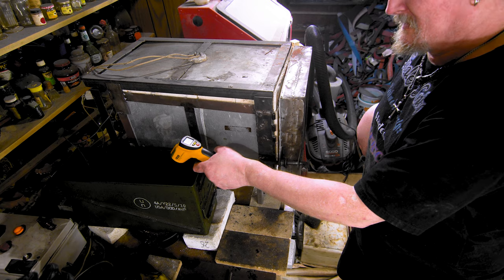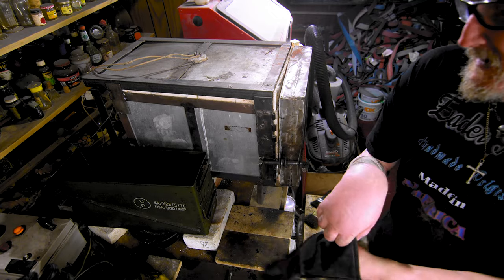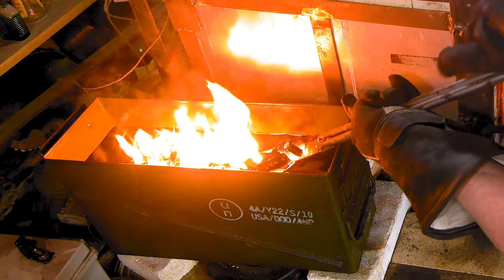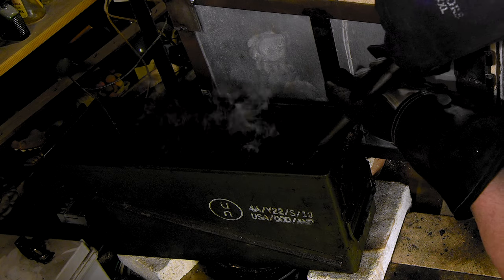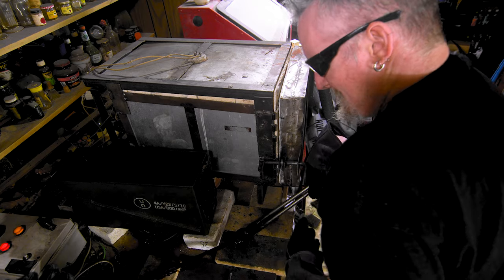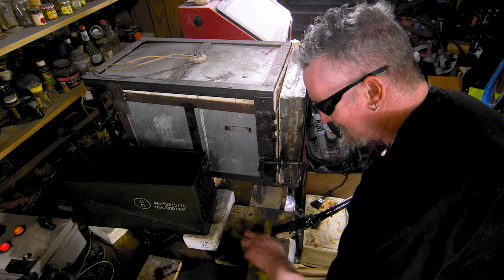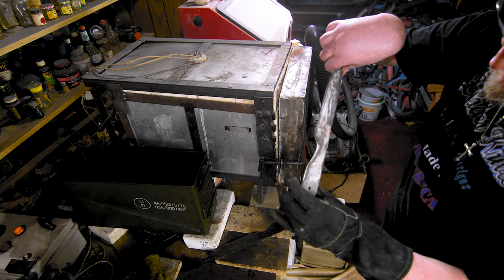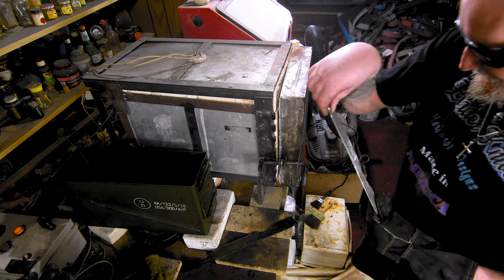All right, our oil's down to 122, 121. Let's get our gloves on and get this bad boy out and do the last one, and we'll get it in the temper. This one still had the paper on it. I couldn't get it off, but that's all right. Probably a little bit of glue too. Whoa! I surface ground them a little bit, but you never know. Oh, this is the one with the paper on it. I guess that other one was just glue. Here we go.